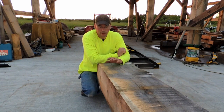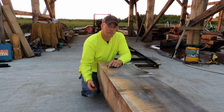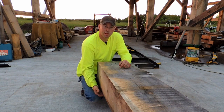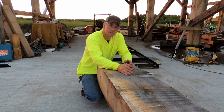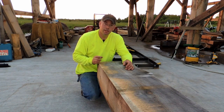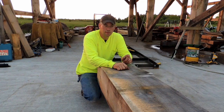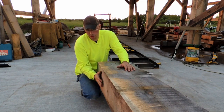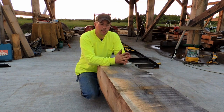Anyhow, like I said — I'll reiterate. Everything is laid out from the reference face. That's how you're going to make sides that aren't square the same as your good square sides. Carry your lines over. When you get to the opposite side from your reference and adjacent face, I'm not taking any measurements other than the four inch lines that I have — not for the length or anything. Because what I found is I've driven myself nuts trying to get that side to match, and they're probably going to be off a little if your timber is out of square. But as long as you're measuring off of the reference face, everything should line up pretty well.